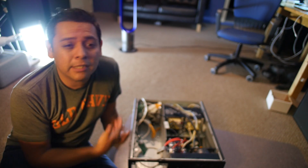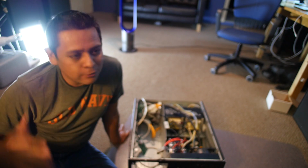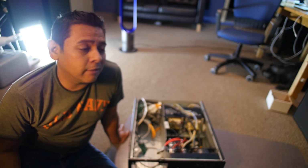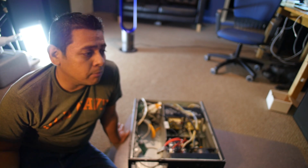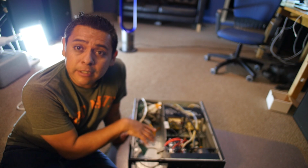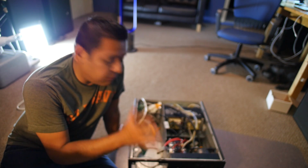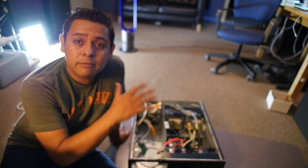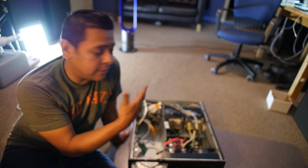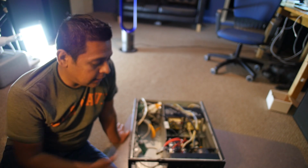Again, if you want your cells to last a long time, you undercharge them to 4 volts. You under discharge them to, you know, 3 volts or 3.5 or 3.2 or whatever it is. I don't know where this thing actually quits. Again, the 55 volts might not be indicative of a good unit. This might be just what this is doing, but because it's a bad unit, maybe I shouldn't put too much attention to it until I get a working unit.